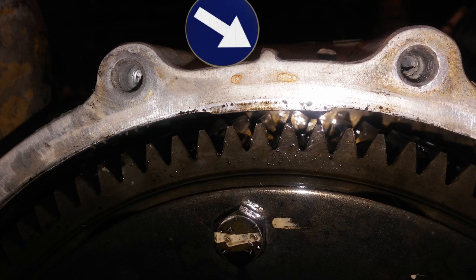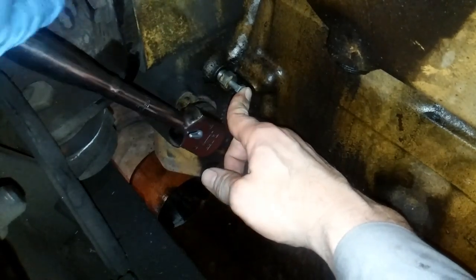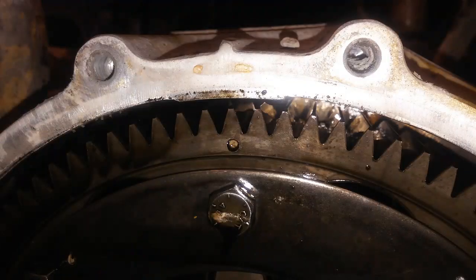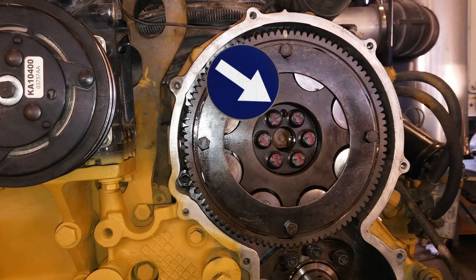What you want to do now is pin the engine. There's a plug on the flywheel housing, and you're going to put a bolt in there and rotate the engine around. When it slides in, that means you are pinned. Now that we've timed the engine, you can see that the alignment mark on the timing cover matches either a dot or an arrow on one of the cam gear teeth — or at least it should. If the cam was out of time, you might have it off by a tooth, or it might be off slightly already; that's fairly normal. Once you're done it'll look like this — you have it timed. You can see the white line on the cam gear lined up with the top of the timing cover.